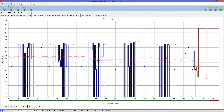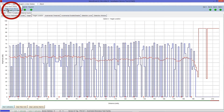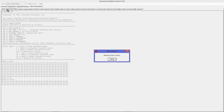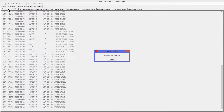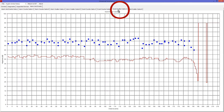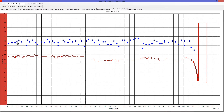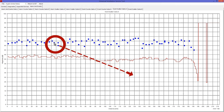Select the Alarm History menu again and choose Retrieve from Device. When the download is complete, select the Event Scatter A tab. This screen will list all reported cable events displayed as blue dots. The X coordinate displays the MicroPoint cable cell number, while the Y coordinate shows amplitude in dB. Moving the mouse pointer over an event point will display the location and amplitude as an XY coordinate. Hover over each blue dot to estimate the average amplitude, or midpoint, of all events.